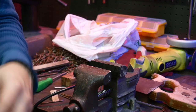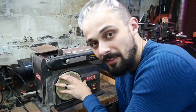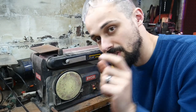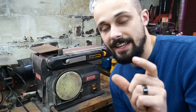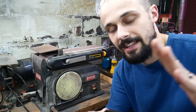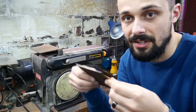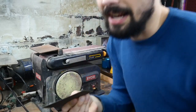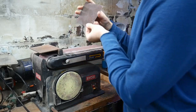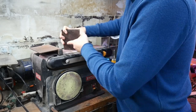On to the second method. The next method is using a power tool — in this case the belt sander. You could use a drum sander; this one's a little small but it would work. I would probably not use a narrow belt sander or a tool grinder because it's gonna be harder to get a good clean flat grind. I'm gonna start on this side, then switch to the side I did with the hand file — you can see it's all shiny.